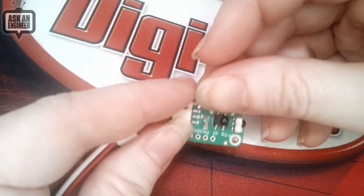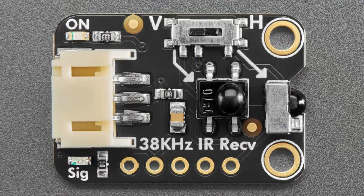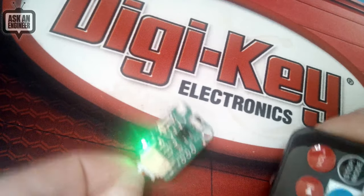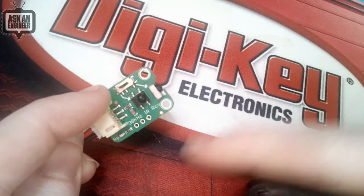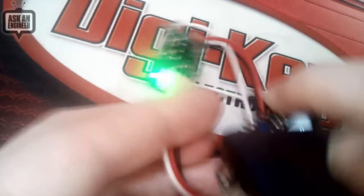On the back of the final version you'll see labels IR-H and IR-V. If you have two infrared inputs on your microcontroller you can get the individual signals from each receiver, as well as the selected combined signal output. Looking at the overhead demo — when you send messages the signal LED goes off to let you know it was received. I have a little example code running here showing each code being received.